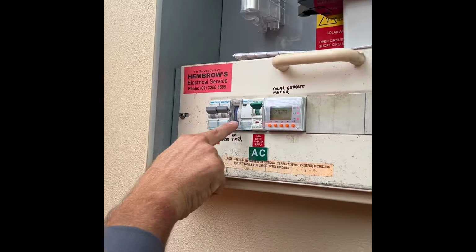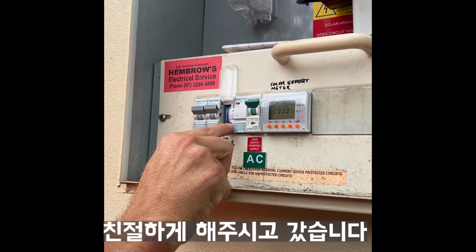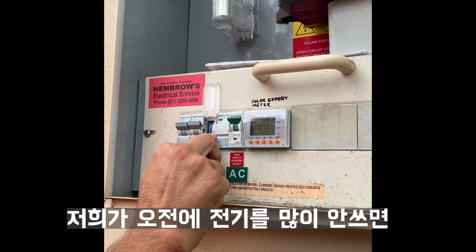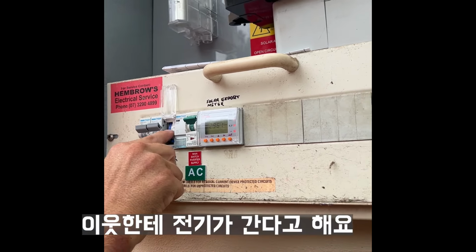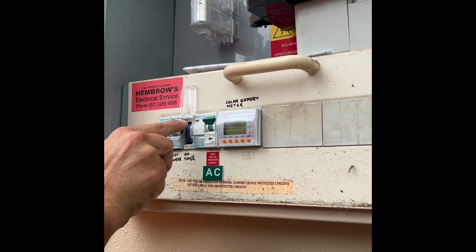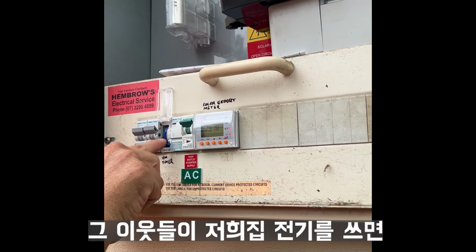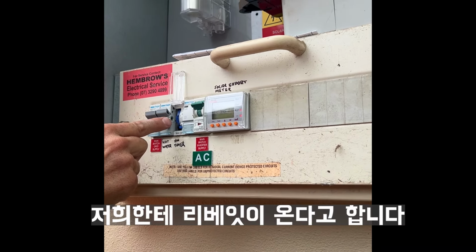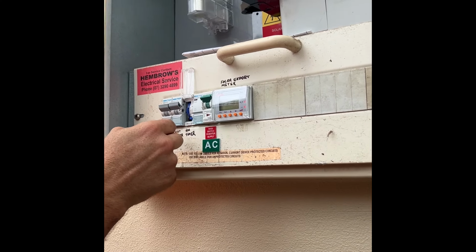So this is the hot water timer here. It's in auto mode, which is that clock. You can choose on, clock, or off mode, but once you've set the time, it just stays on the clock mode. And then these little blue toggles, if they're switched to the right, that means it's on at that time. If it's switched to the left, which you can do with your fingers, then that's off, between say 10 and 12 there.